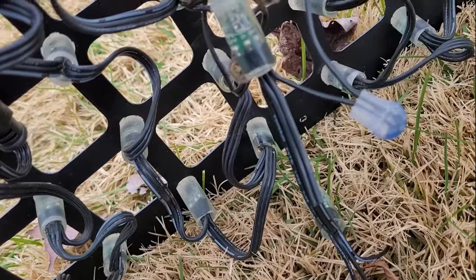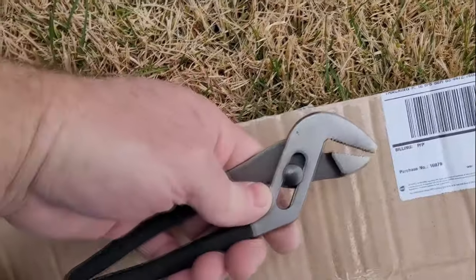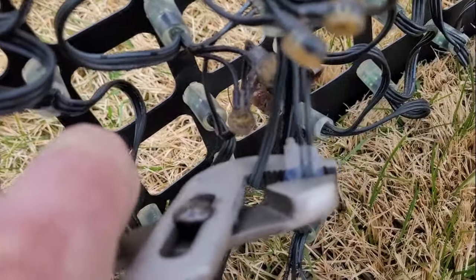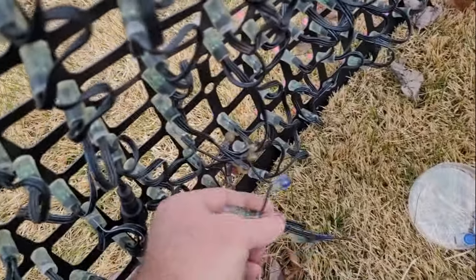You can see this is the data inside of the pixel — right in the center it says 12 volt DI GND. I've already got my connector here on the dashed line on the output side to match up with the dashed line on the input side. It's just a matter of getting those slid into the back there. I have a pair of channel locks here and I use these with one notch down. I'm going to take them and slide them right onto my connector and squeeze. That should squeeze some dielectric grease out of there — that should be a good solid connection. I'm going to plug in the power cord now to see them light up. We have our first pixel repair there. Let's go ahead and splice these other two in.